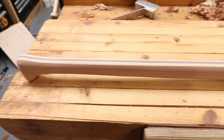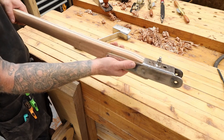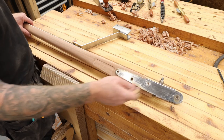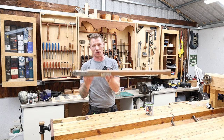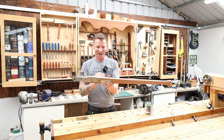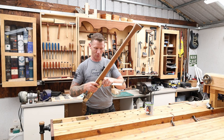We're all sanded up and everything is fitting nicely. Next thing is to drill the holes, but I'm actually going to take this to the boat to drill those holes because there's a little bit of adjustment in this bracket - you can change the angle to suit what you need. I just want to be 100% sure I have the handle coming out at exactly the right angle. About a week later - I have all the brackets drilled and fitted. I took it to the boat, made sure everything was lining up, clamped the brackets on, and used a sharp brad point bit using the brackets as a guide to go straight through the timber. The auto helm bracket is now drilled and permanently in place as well, with brand new stainless steel bolts to go through.